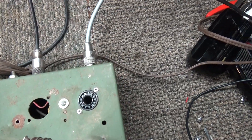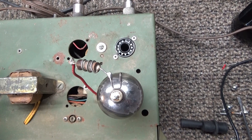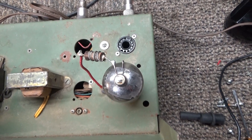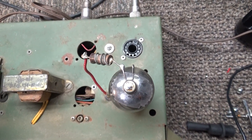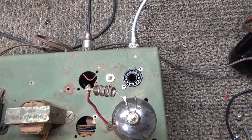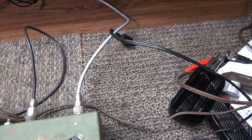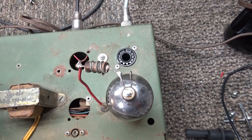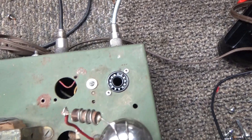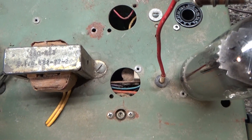Come to find out it did have two tubes, but they were six volts in series for the filament. Mako uses a 12-volt filament transformer, so does DNA, and you'll usually find tubes in pairs — two 6V in pairs for the 12-volt filaments. But the one tube was only in line for the filament; nothing else was connected to it. They were 6LB6s. I noticed there was only one plate cap coming out, and wondered why you'd have two tubes with only one plate cap.